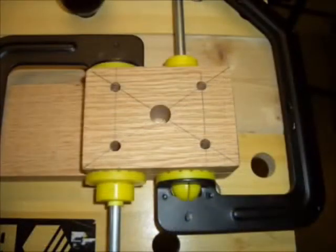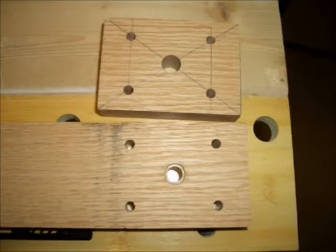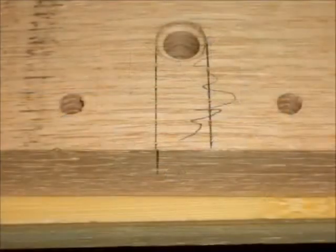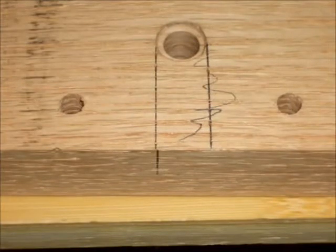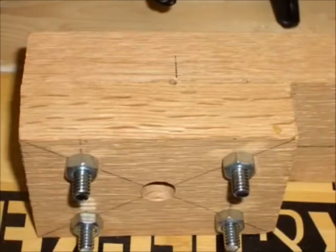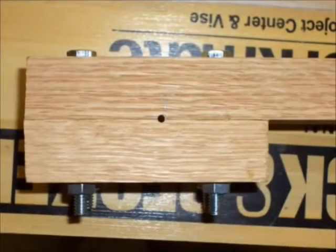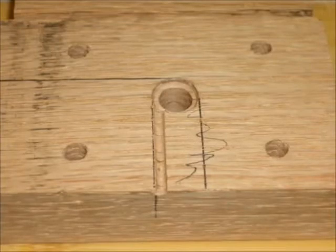The hole in the middle on the front side of the jig is a half-inch diameter hole. The hole on the back side of the jig is a 3/8-inch diameter hole. When these blocks are bolted together, a 3/8-inch diameter steel rod will pass through the larger holes in the middle. I then laid out and drilled about a 1/8-inch diameter hole that went along the face between the two boards and intersected the larger hole in the front of the board tangentially. You can see the small diameter hole at the top of the jig — this is the hole into which the wire will feed, and then the wire will wrap around the 3/8-inch diameter steel rod.